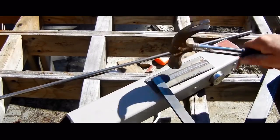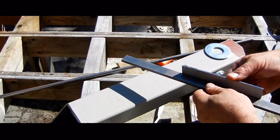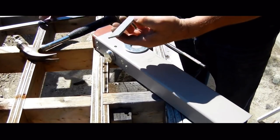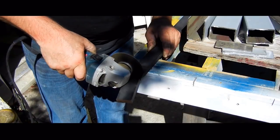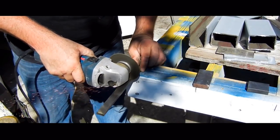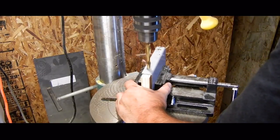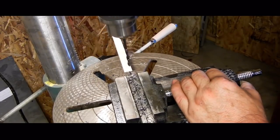Some pieces have to be pounded flat after they've been cut out. This is half-inch thick steel for the nut assembly and quarter-inch thick steel for the jaw pads of the vise. A little deburring to clean up after the parts are cut out, then I can start on some of the machining by drilling the holes that are needed and reaming them out to the correct size.